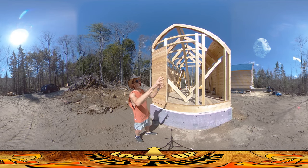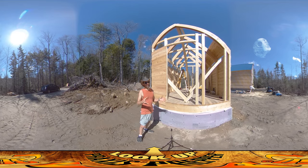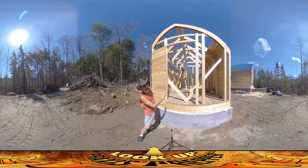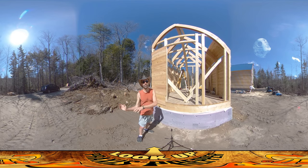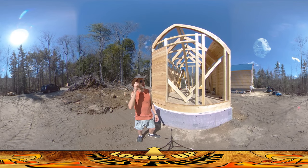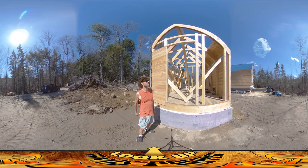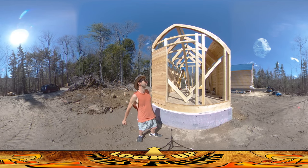I opened up the house, all the windows in there, and I've been running the fan that's grabbing the hot dry air from the top, pumping it down into the slab, warming up the slab, drying out the slab, which is the critical thing. I don't really care what the temperature of it is at the moment. In the summer it'll be nice if I had a cold slab, but right now I'm just trying to dry that slab out. There's a lot of moisture under there from all the rain that had been falling in. I just want to get that bone dry under there.